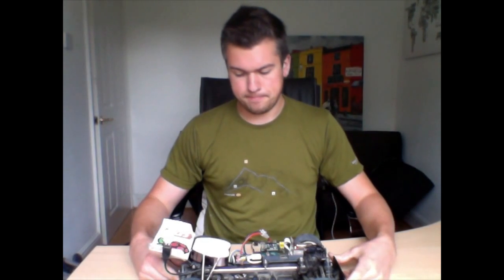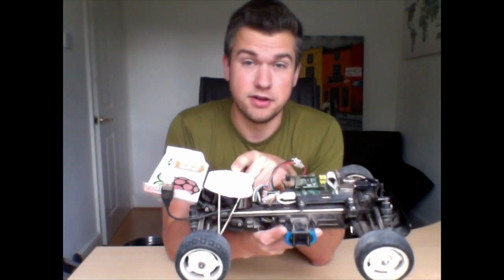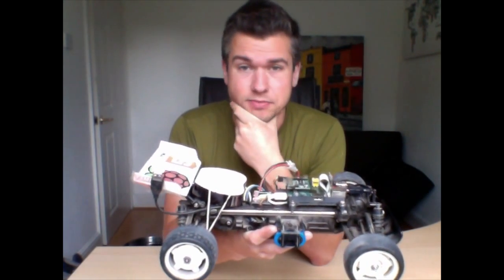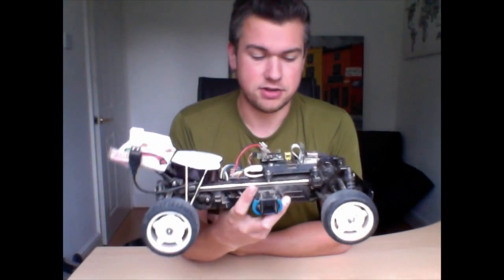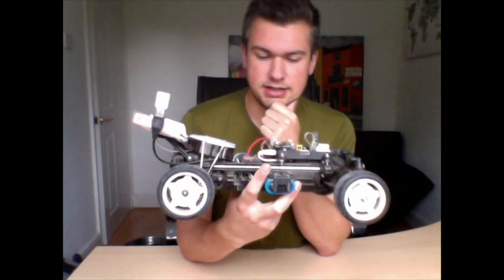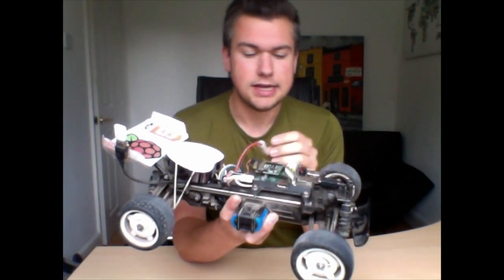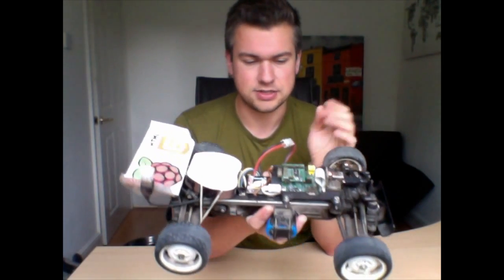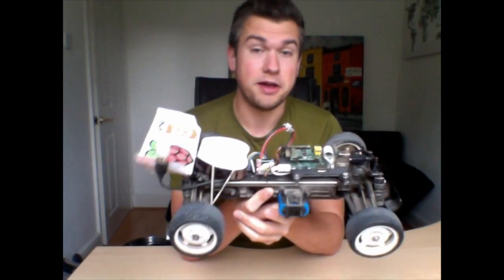Software. I'm running the Raspberry Pi using a 5-volt top-up power supply for a mobile phone — I think it's 6,000 milliamps, so it's quite a big supply. It'll run the Raspberry Pi for about 6-7 hours. It's got a battery indicator on the back, charges up in a few hours, and that's running the Pi and the camera board. Initially I had the Pi powered off the speed controller because it can feed power back through the GPIO ports, but when the motor drew too much power it would cause it to restart and do unusual things. So I cut that off — own power supply — and the car has its own power supply. That way it's perfectly stable, and when the car goes flat the Pi keeps on running.